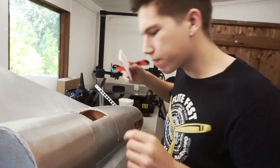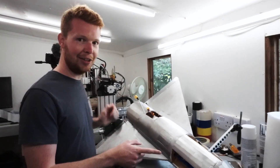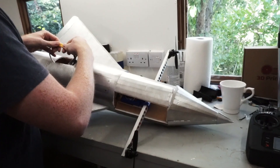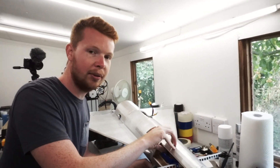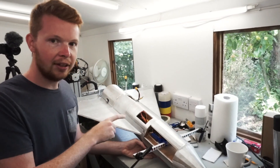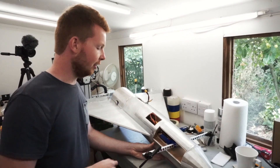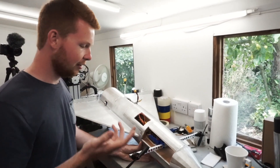Since I made all the electronics I'm responsible for everything, so we've had a bit of a problem. There's a BEC in there - a battery eliminator circuit for anyone who doesn't know - and basically it's not powerful enough to power all of the servos. It's got a large servo in here for the tilt mechanism, and with the other servos and the receiver the voltage drop is too much. The receiver cuts out as soon as it goes below five volts, so we need a stronger BEC to power everything.